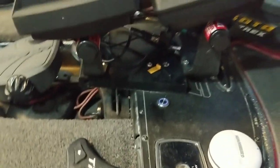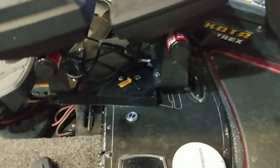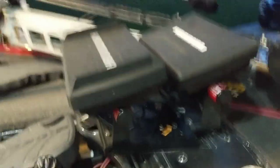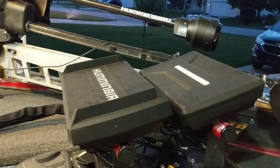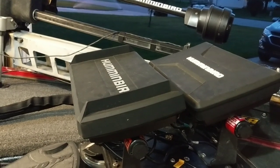I was a little worried about the LED maybe giving me some interference, so my plan was if it did I was just going to wire it without the LED part. But so far so good. I had a little bit of interference from my trolling motor the first day out in deeper water, but I just quickly turned interference rejection to two and everything was gone.